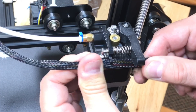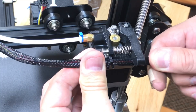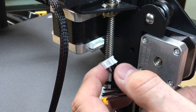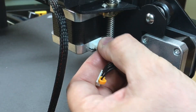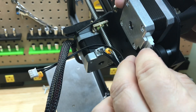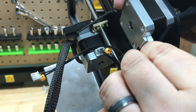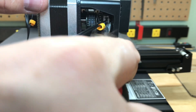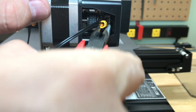Sometimes you have to unscrew the extruder connector to feed filament, so that's why I don't tighten it with a wrench. Then take the harness and twist it into the spot where it holds. There's an E connector — connect that to the extruder the same way you did the Z — and then there's also an X connector. Put that into the X motor the same way. The X stop switch is hard to reach so I use needle nose pliers to put the connector in place.